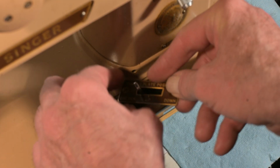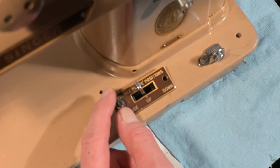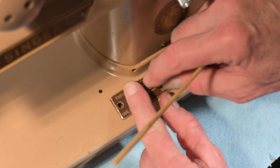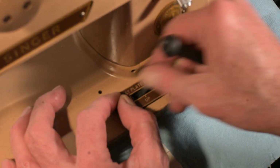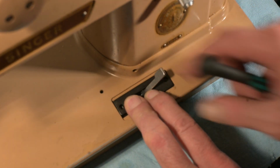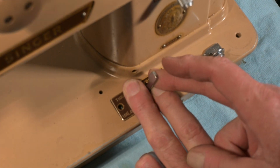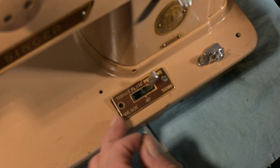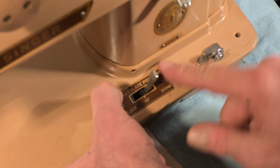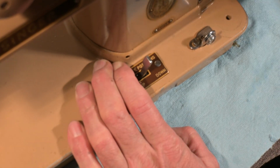Now I'll get the little nameplate and the two screws. So now I've got three things for the screw to go through: the nameplate, the top spring, and the bottom spring. Sometimes it is awkward. The way to make sure the bottom one is pressed over is to put the lever as far over to the right as I can, I think. You know what, I'll put it in the middle like that for now. Okay, that's why I want to have that lever over to the right. We get it over, cool. So I got to make sure it's over to the right when I got everything assembled, and then everything will line up pretty close. There, that seems to be a good spot. Let me get my probe and line all three of them up. I could see they were askew. Now that doesn't feel exactly flush, and it's not. So I think there's going to be an issue there. Yeah, it's not flush, so let's not even waste my time.